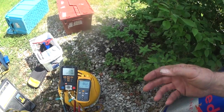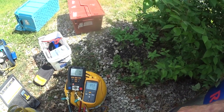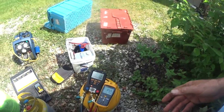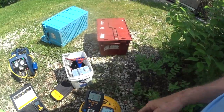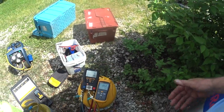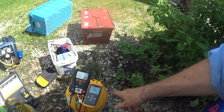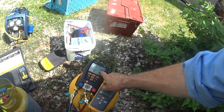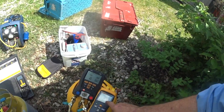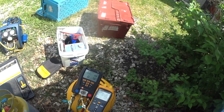The degradation is probably from refrigerant leaks — losing some gas over time and what's left behind. It's a good way to check whenever you reclaim refrigerant or you have refrigerant in a system, to see if the integrity is good or not. It will vary — I've had a pretty big difference before. Right now it's down to 89 on pressure and 86 degrees on temperature, so it's fairly close.